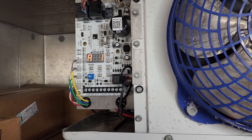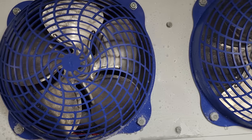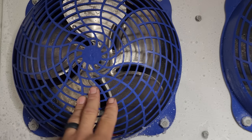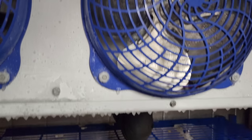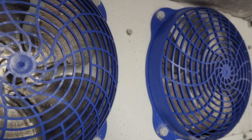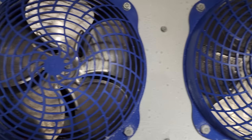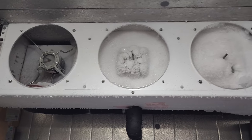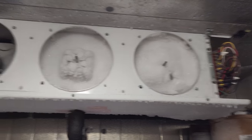Lucky they don't wash out the oil on that compressor because it's been running without these evaporator fan motors. I'm going to get some hot water, get this powered down. We've got to get this defrosted, get some pans down here to try to catch the water because there is going to be some dripping water. Then try to figure out what's going on. This is the worst evaporator I've ever seen as far as being iced up.